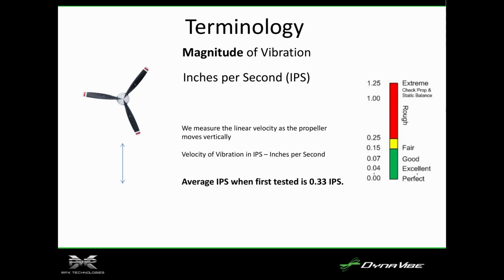How does something like that happen? I'm assuming it got twisted and then someone repaired it by just retwisting the tip. We've also had issues where a propeller was really bad. We sent it back to the repair station and they said, oh, the weight that we have assigned to blade 3 actually goes on blade 2. Everybody makes mistakes, I think that can happen. We found on that particular prop that all the weight was offset from the weight that they put on. So it's like, well, this weight's exactly in the wrong spot. It's really weird. Send it in. There are a lot of things that can happen in that regard.